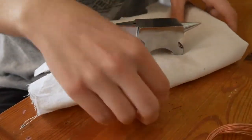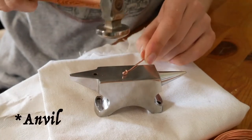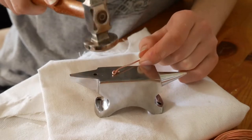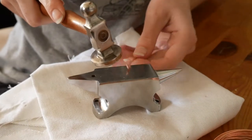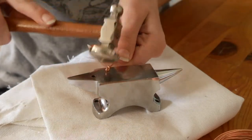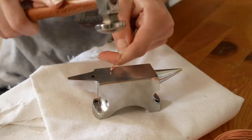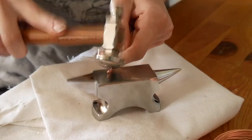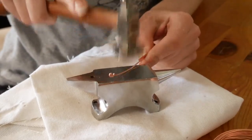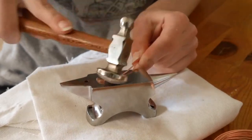Once I've gotten that somewhat worked down, I'll take it to the anvil and start hammering down on both the top nubbin and the rest of the wire. What I do is hammer it down flat-ish, then turn it on its edge and hammer it down the opposite way, constantly going back and forth, trying to keep it as round as possible. The most important thing is we're trying to harden it by hammering it down multiple times — I'll keep working it around until it's rounded-ish.